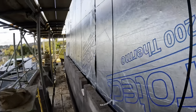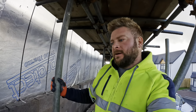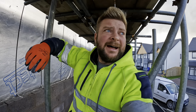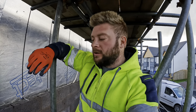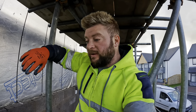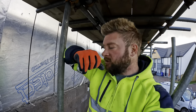So the plan is just to get over to the top lift here to the gable end. And then we're going to be shooting off to about 2:30 with a full mix to bed and pad stones right at the top of that gable end, because it's quite a nice day today. And that tooling out on the garage over the road, finish that. So them two jobs will be, well, one of them will be finished for me. I've got to go back to do the rake cuts for the gable end once the joiner's been there and sorted out the roof, but pretty much done.